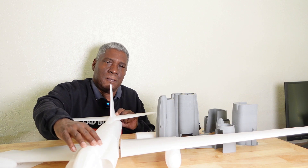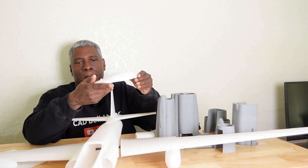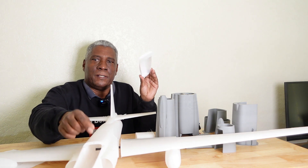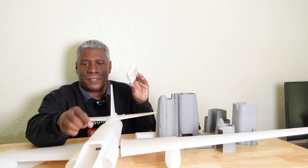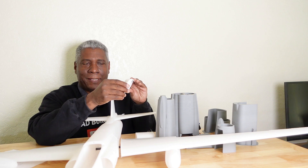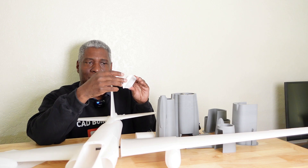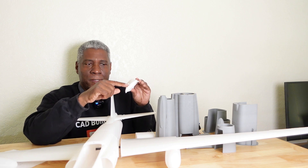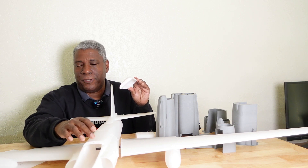The hatch up here comes off and this is a press fit type hatch - it goes down in here. So this piece that comes out is a press fit down inside of here. This little slot here means it's just a little tiny amount - so when this slides back it's got enough tension on it to hold this back and lock up in here. That's another great design. I've seen a lot of other people put a 3D print spring in here for that, but I like the press fit idea too.